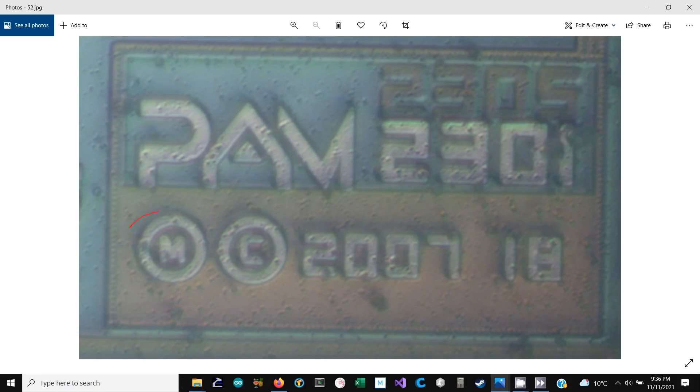There's also a voltage reference bandgap, which is used to set voltage very accurately. You can see all the pads here for connections to other devices - two pads here, which is common when looking at something carrying a lot of current, since two bond wires allow more current to be carried. The maker's marking shows copyright 2007, and there's also an M in a circle which is a mask marking - there's actually a specific law in the US on intellectual property dealing with integrated circuits. The silicon is quite stable at 2007 - you don't see a lot of changes in power supply circuits; you can design them and use them for decades.